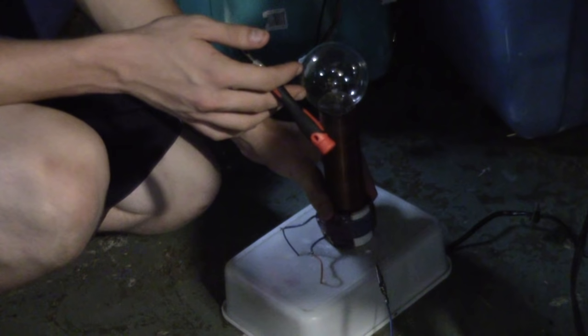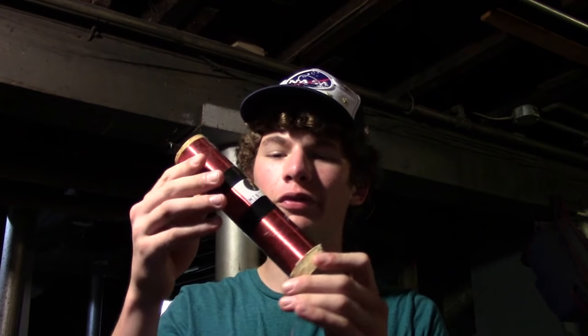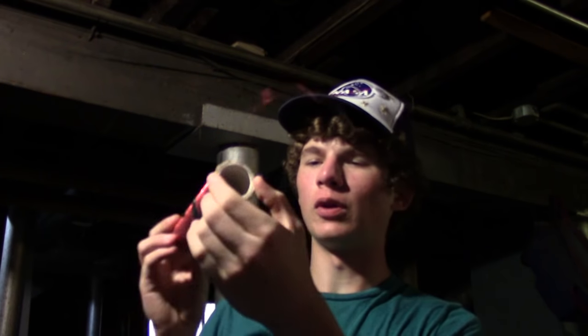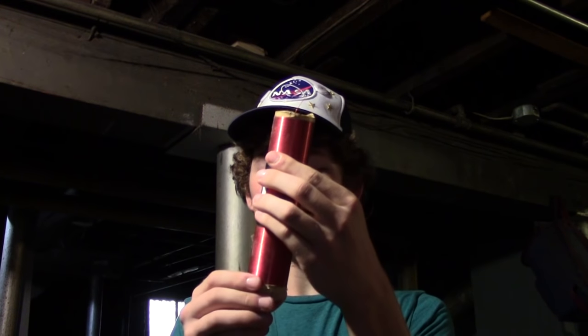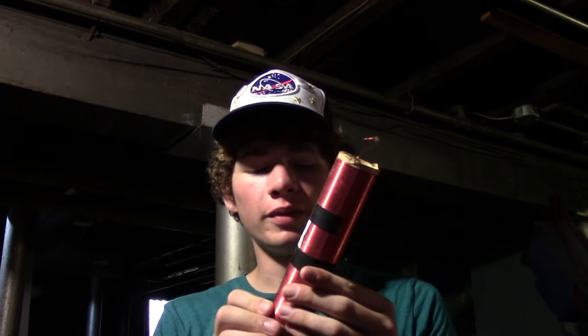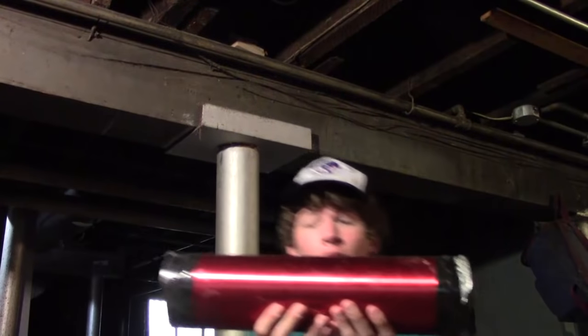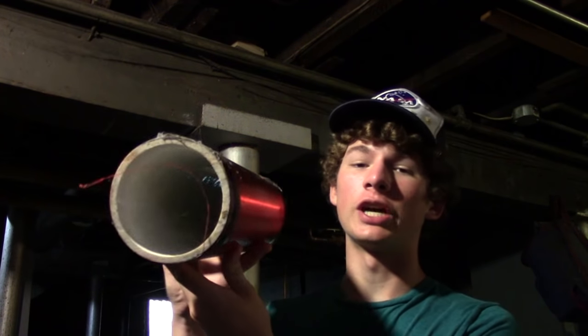Now I'm going to show you some of my other Tesla coil designs and how you can improve this once you've built it. This is a secondary coil I built a few years ago called the Minitron — it's just about a one and a quarter inch PVC pipe with 26 gauge magnet wire wound around it. It's really beautiful; I sprayed it many times to keep it secure. I whip this out every Halloween or so. I also have my biggest one to date: 26 gauge magnet wire around a four inch diameter PVC tube.